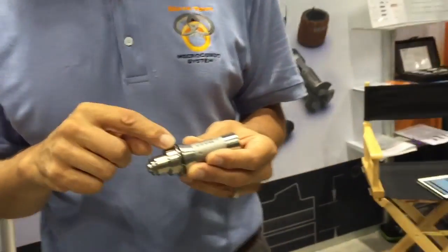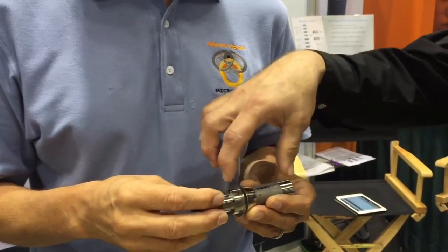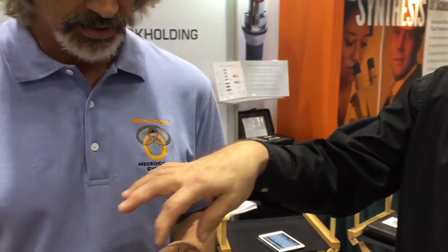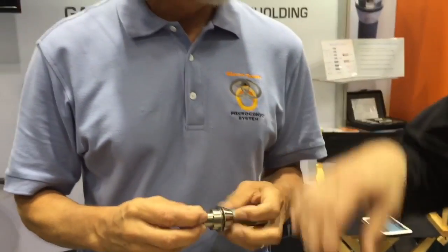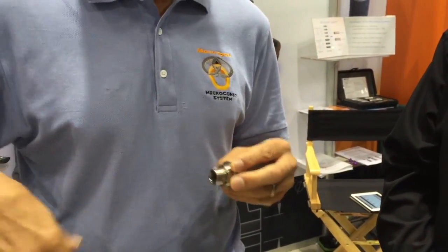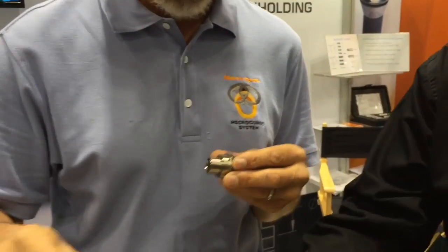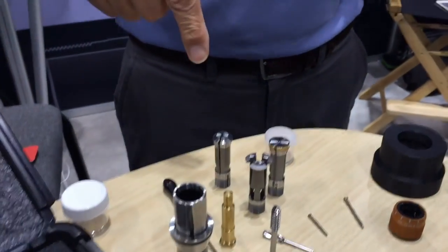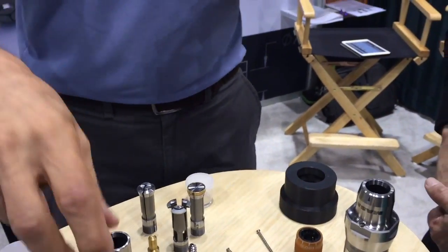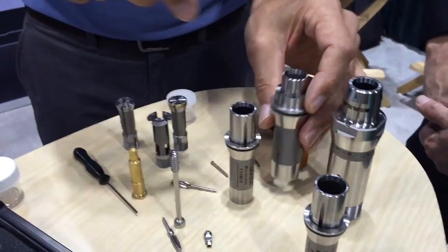The cartridge is like a sleeve — you put it in your spindle and you can leave it there. Any of our collets will work in the cartridge, and the same collets fit both the cartridge and the spindle sleeve. So you can do over-grip and standard — once you buy the cartridge you have full flexibility.